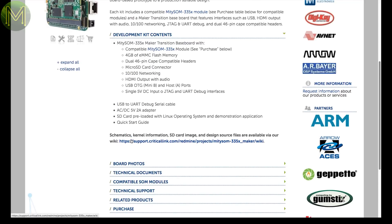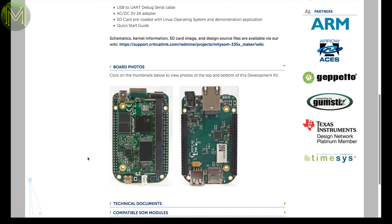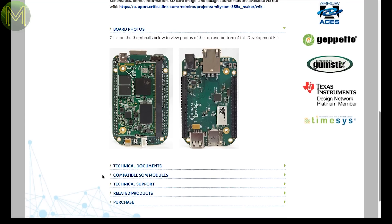It contains TI's Cortex-A8 Sitara SoC running at 1GHz, either 1GB or 256MB of RAM, 1GB NAND flash, 8MB NOR flash, dual gigabit ethernet, LCD with touch, two USB, three SDI ports, and a bucket load of serial interfaces. Unfortunately, since the format isn't common, they are expensive.